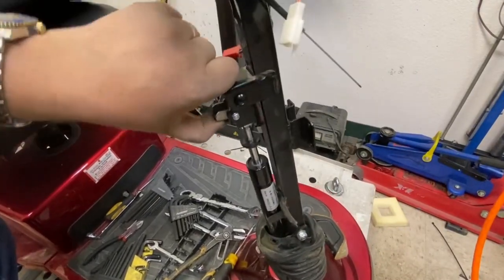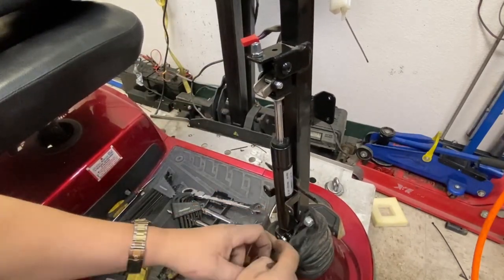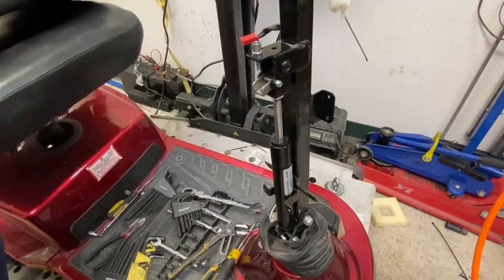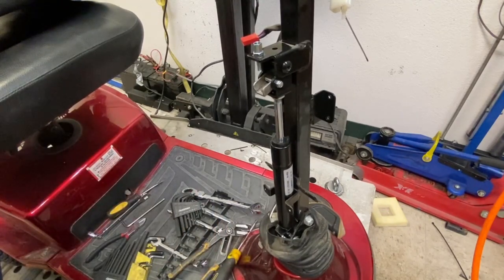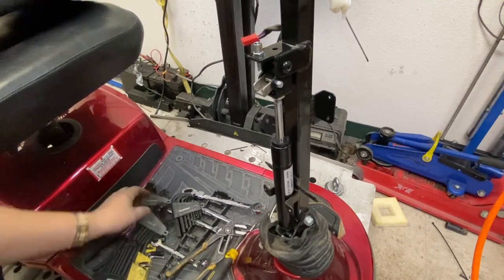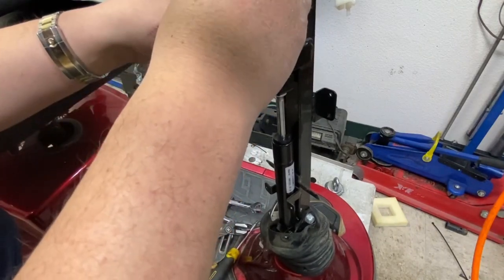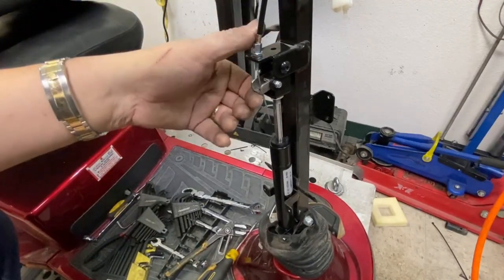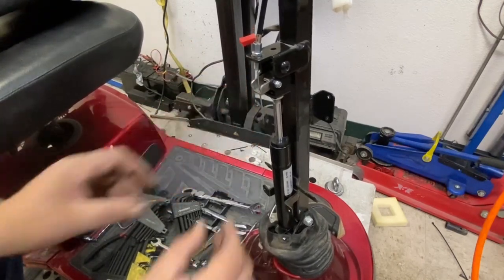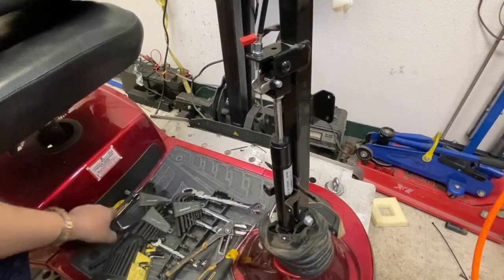That's your piston in — that should operate nicely. The pin's located in the correct place, so that's all back together. Now it's time to add the cable to that piece we've just installed on top of the ram. Thread that through the bottom locating adjustment nut — that's actually holding there loose, it's not threaded in at all. The locking nut will adjust it. Then thread it through the silver portion, which is the bit that operates the ram — it puts that plunger up and down.